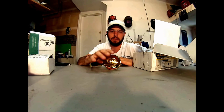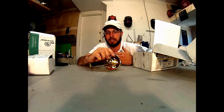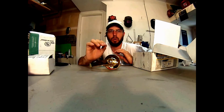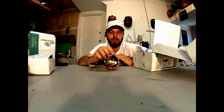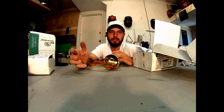So this is a great product and system to use because it's a fine line of conventional use. It's going to take the place of whatever's already there, in quality and durability. Will a Schlage or Sargent lock last longer and open and cycle more times? Probably, yes it will. Is that relevant in the course of the average business lifespan? It's just going to depend on where the door is. An office door is going to get opened 5-6 times a day. You add that up, you're going to get your 500,000 cycles.